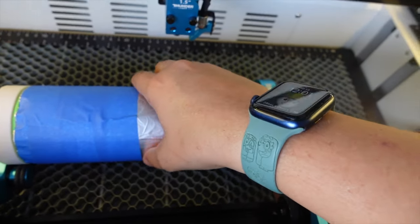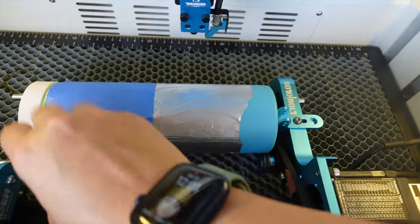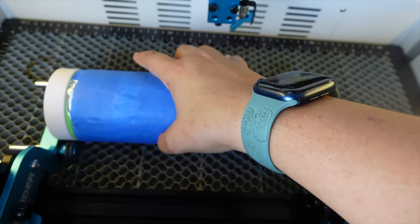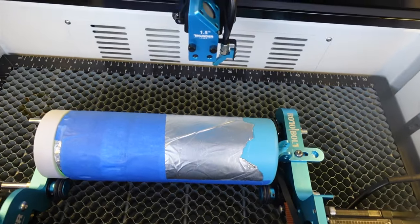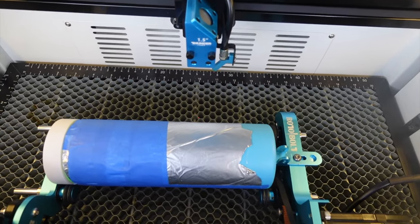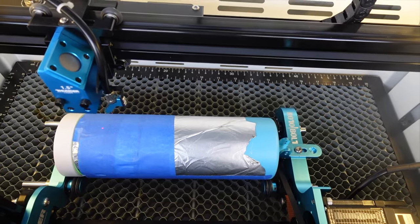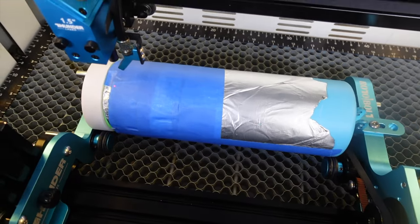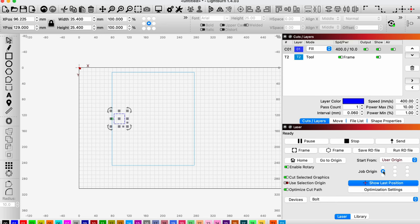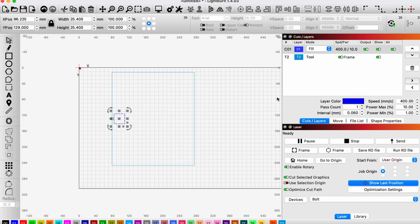I have this already sized in there properly. I butted this up all the way to the end and then pushed it slightly to the side so it has some free movement there. Doing a little test, you can see nothing catches and it can move freely. Let's lower the bed a little bit — just enough so that the laser head is not going to bump into anything. You can see our little dot there, and I'm going to put it over here to the side, then hit the origin button and do autofocus. In Lightburn we have our artwork in the left center, user origin checked, and enable rotary checked. So we can send this. I'll title it 'test' and click OK, and the laser will beep saying it got it.